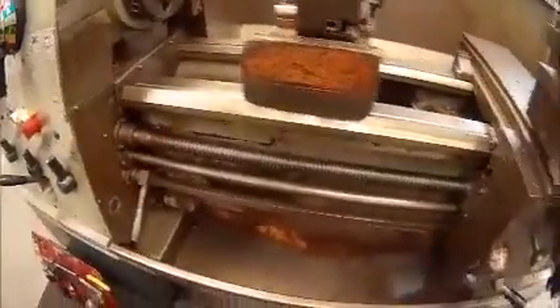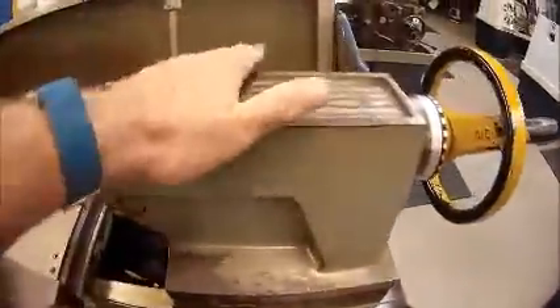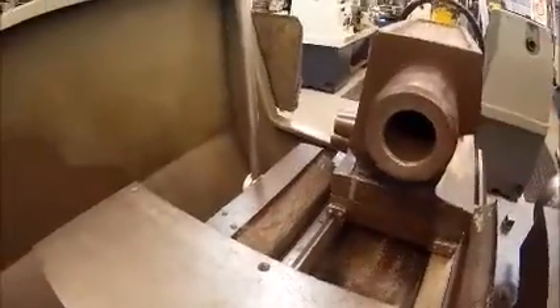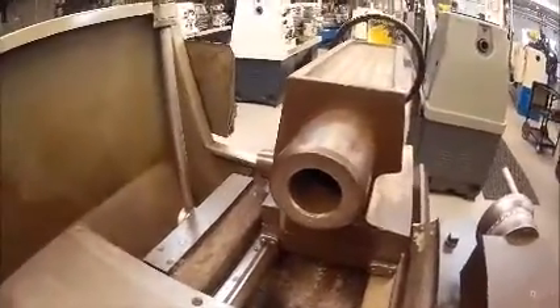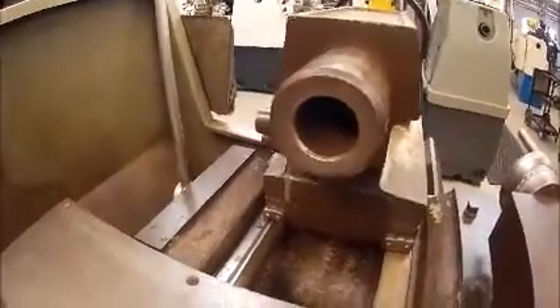Some of the other major components of the machine are the bed, which travels the full length of the machine. I have a tailstock at the rear end, and inside the tailstock we have a spindle. The tailstock spindle has the number four Morse taper machined into the end of it. I can use this to carry things such as drill chucks, drills, reamers, centers, and other bits and pieces which can help me machine certain components.